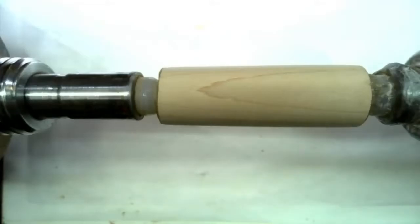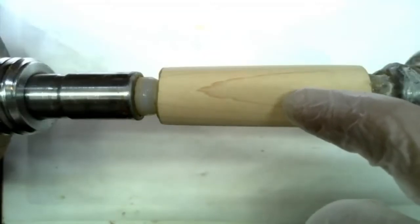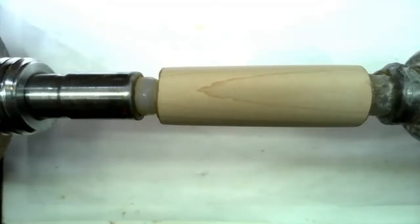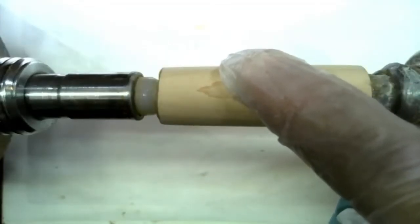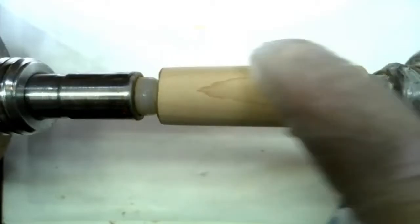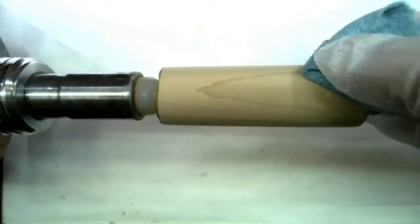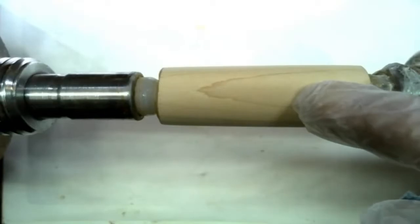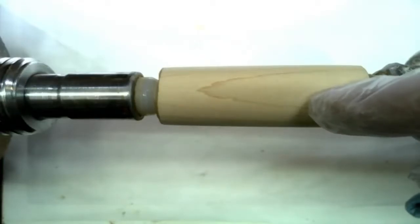I like to do it this way because if I actually took this blank and I looked at it under a microscope, I'm going to see a ton of little divots in there, right? Because that's just the sanding process. I've sanded this blank down through all the common grits, and then I've taken the first two series of micro mesh, and that's it. It's very, very fine on here, very easy. So I'm not going to need to go back and do anything with that. I'm simply going to start at this part, use the medium to fill in all the little imperfections, and then use the fill and finish thin, just simply to act as the finish, to do what the finish was intended to do.